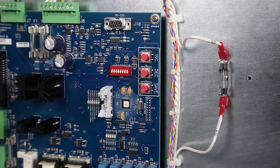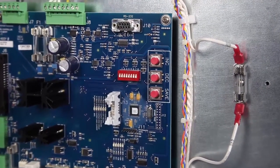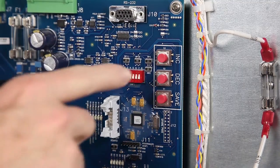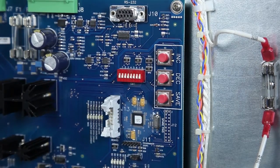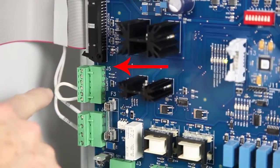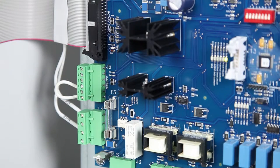Controller board 44A7293 is used for control of ADB-CSF regulators. This board has three buttons that are used for calibration: increase, decrease, and save. For 3-step operation, verify there is a jumper at J5 between pins 5 and 6. No jumper is required for 5-step operation.